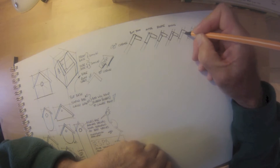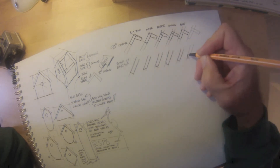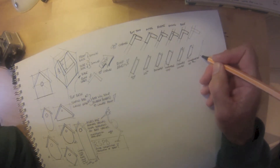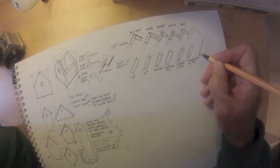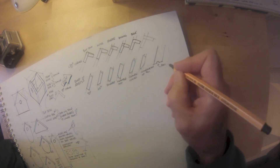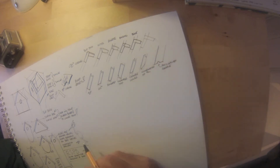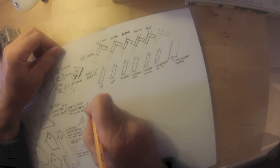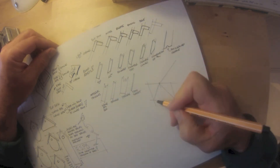We're going to look at a way of generating ideas very quickly — looking at possibly five different combinations for one of those house shapes. The first is a method of constructing the right-angled roof structure. The second is the end shape of the roof: right-angled, 45-degree, rounded, chamfered, combinations, or even a groove to stop water tracking back — called an anti-capillary groove. The first consideration is the pitch and how we join it: butt joint, mitre, rebate housing, or bending a material to get that right-angle bend. Second is ways of finishing the end, which makes a big visual difference, and third is the material — specifically the thickness, from thicker to thinner sheet material.